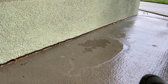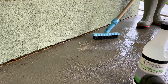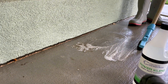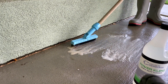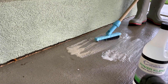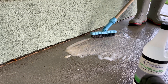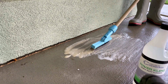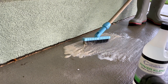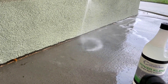If you have any oil stains in your concrete, you're going to want to degrease them after your initial pressure washing. Go in and put some degreaser down and scrub that area really well. This usually doesn't remove the stain completely, but it will lighten it up and remove the oils from the top of the concrete. This is very important before moving on to the next step. After you're done, rinse that area really well with the pressure washer.